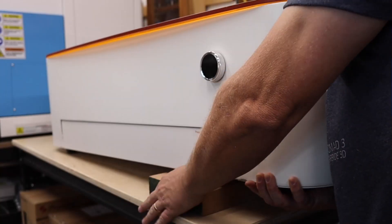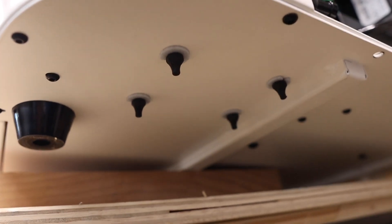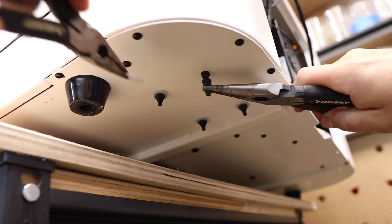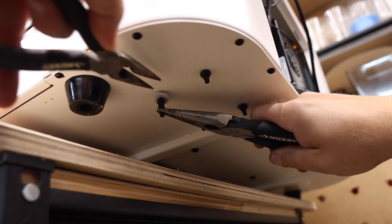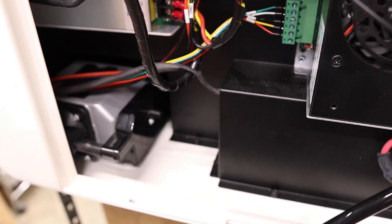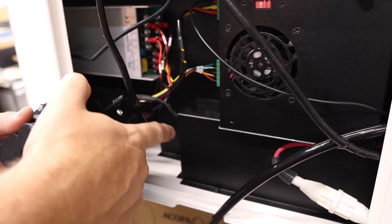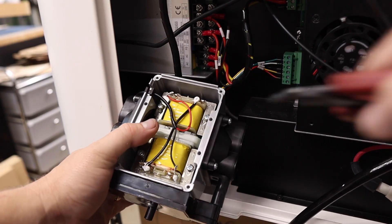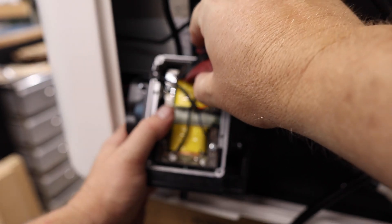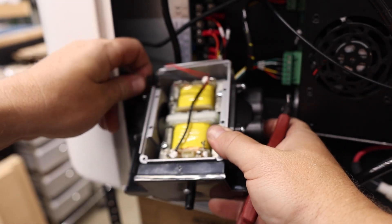To remove the stock air pump, slightly prop open the right side of the laser a couple of inches. I like to place a 2x4 or other off-cut of wood underneath to get some distance between the bottom of the laser and my bench. You'll need this clearance to remove the plastic clips located here. I used two pairs of needle-nose pliers to remove these clips — one pair pulled the rubber foot down and the other popped off the clip. With the clips off, you can remove the black rubber airlines from the front outlet of the pump. Before we can remove the pump completely, we'll have to deal with the wiring. Turn the pump upside down and remove the screws from the access panel underneath. With the access panel removed, you'll see two wires — a black and a red. Clip off these wires with wire cutters and set them aside. We'll reuse them in a minute. Now the pump is free to be removed from the laser.